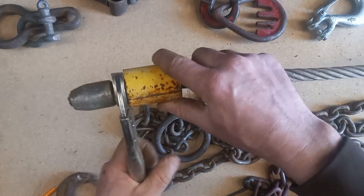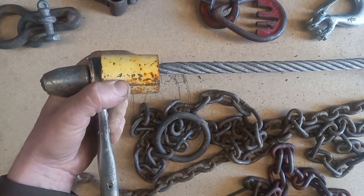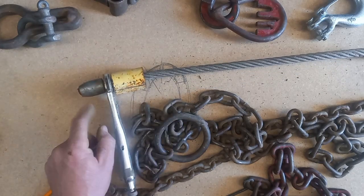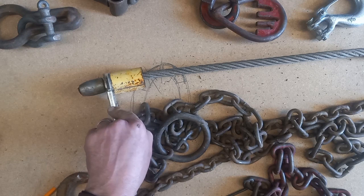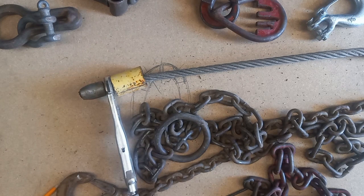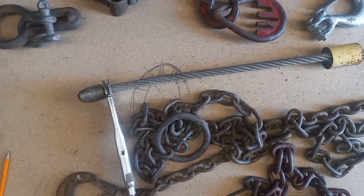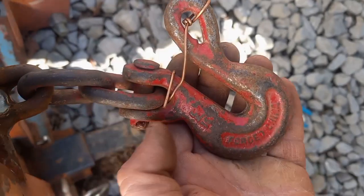This is welded to your chassis. Buy 10-foot chokers — don't buy short ones. If you're going to flat drag stuff you need all the length you can get. If you don't believe me, see the video 'Poor Man Dozer Logging' — this choker and this vice grip pulled a 60-foot pretty good-sized single-stick red oak out of the woods and across the road to the landing. I don't have a big winch on my machine yet — just don't have all the hydraulic parts. Where there's a will there's a way. Weld something on your machine, get your vice grips and a choker, and get after it.